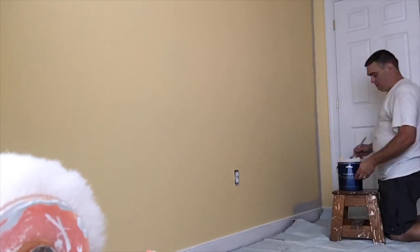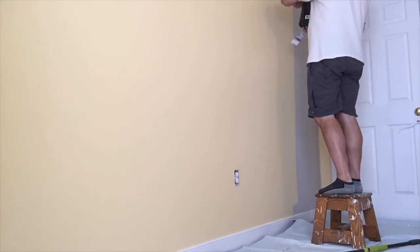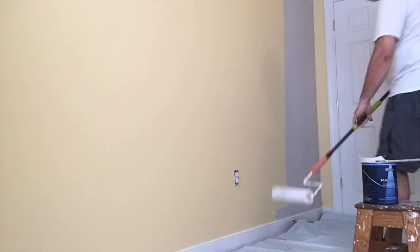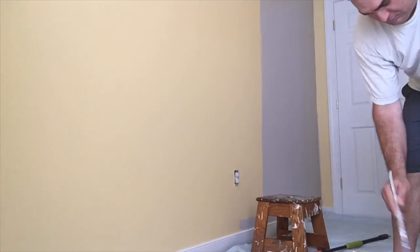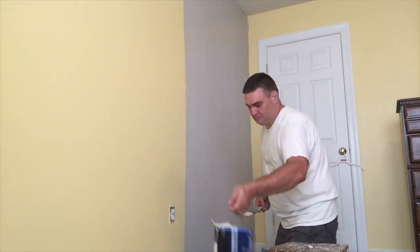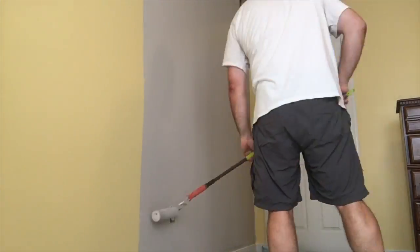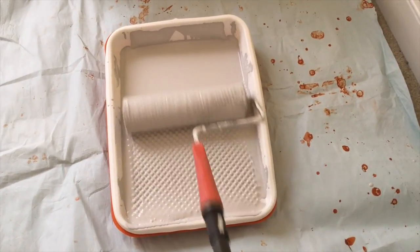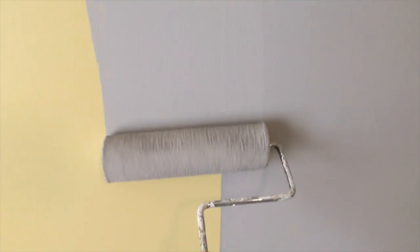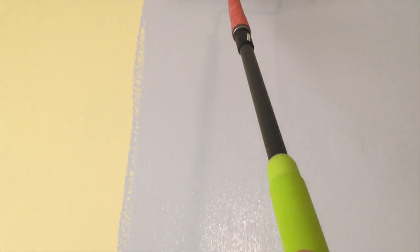With all our important prep steps completed, it's off to painting. As you can see, I start off with the edges using my two and a half inch chisel tip brush — again I use Purdy — and then I start with the roller, rolling about two to three strips wide, keeping a wet edge and edging again. Here's a closer look at how I load the roller brush: I pull a little bit of paint away from the puddle and then evenly spread it on the roller head. I'm rolling up against a wet edge, apply the new paint, then go back over where my fresh paint and wet edge meet and do a feather stroke.